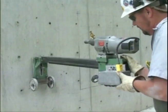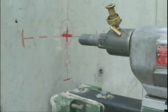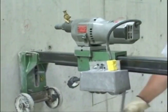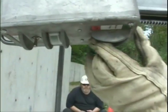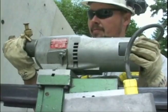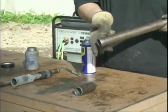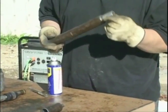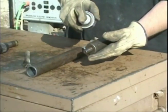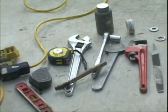The core drill carriage should fit snug to the column, with no excess play or movement. It should be keyed to the motor base for accurate alignment. Rack gear should be working smoothly and not missing any teeth. The core drill motor, on and off switches or valves, should be in proper working order. Alignment to the column has to be accurate. Water swivel or jacket should not leak. For bits, adapters, reducers, and extensions, make sure that all adapter threads are in good shape, cleaned and lubricated prior to connecting them together. Here are some of the common tools needed for coring other than the core drill.